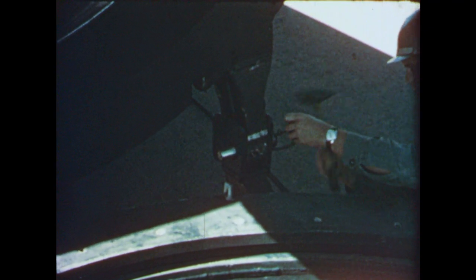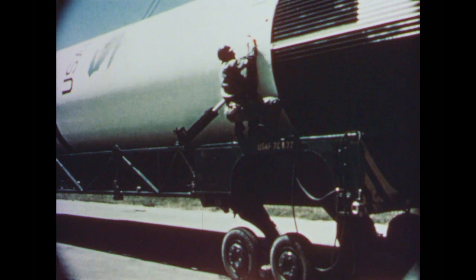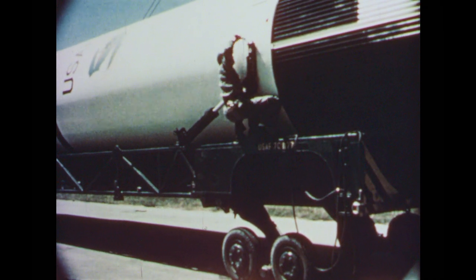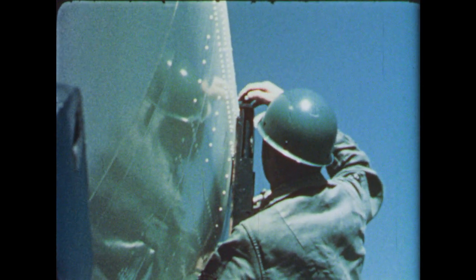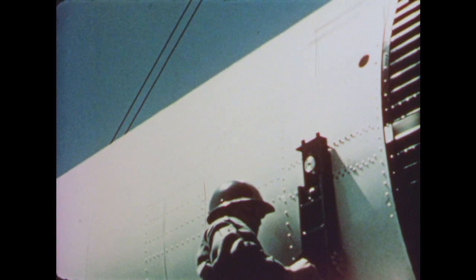As might be expected, the pin on the second trunnion may be more difficult. A close tolerance is required at the pivot for missile stability. It may become necessary to drive one of the pins through. Hold-down arms extend from missile bolts to transporter at the aft cradle. When the safety locks are removed from the arms, the missile will be free to pivot toward the launcher since the forward arms were released earlier.